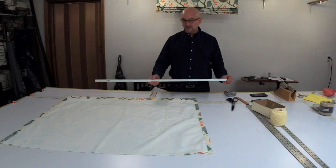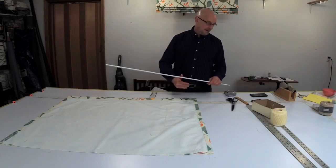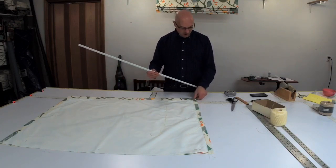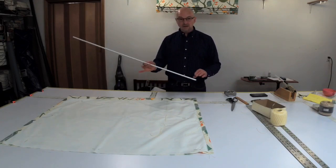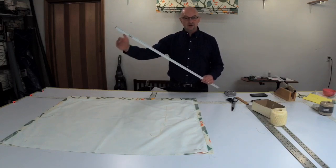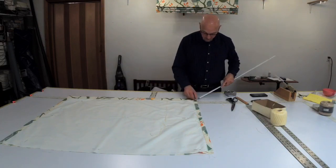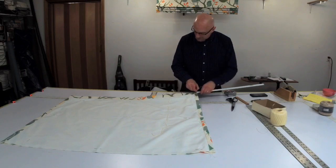You cut it with a hacksaw. You get it to the width of your shade less 1 inch. So this shade here, I think it's like 34 and a half. So you're cutting this about 33 and a half inches, so you can still close up your shade. Again, it's what they make the actual frame. So you'll find this in with all your screens for your outdoor windows, that window screens. And so what you're going to do is you're going to put this little guy inside the bottom of your hem.